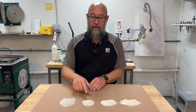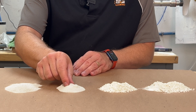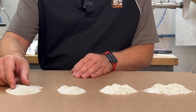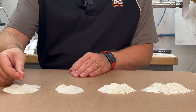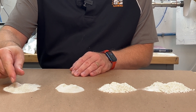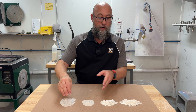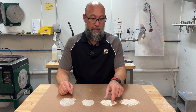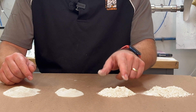Above zero, you'll have the one half, which is a little more abrasive — you can see from this that it's a little sandier. This is a number one pumice and it's almost like play sand in a way; it's very abrasive feeling on your fingers and really just kind of moves like sand. If you move over to these finer pumices, you can tell it's a much finer abrasive because it's powdery and wants to clump together.